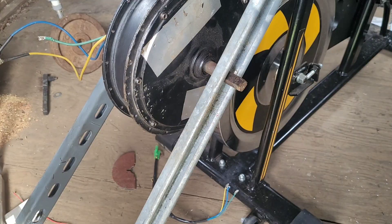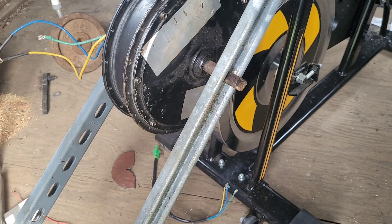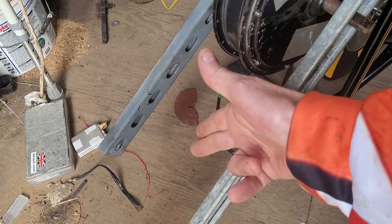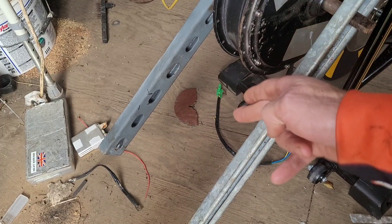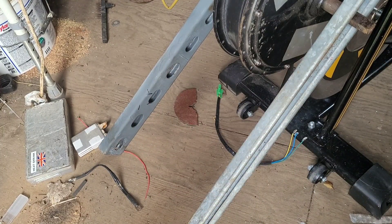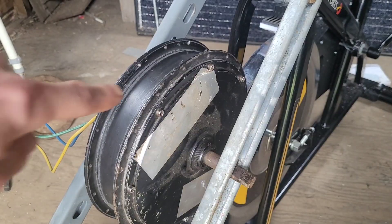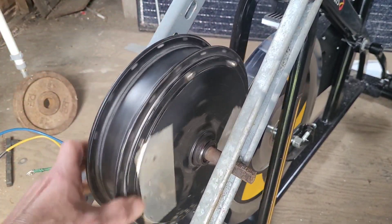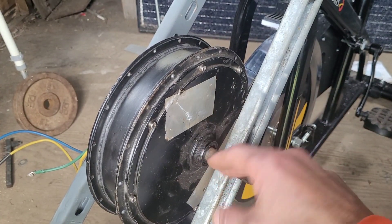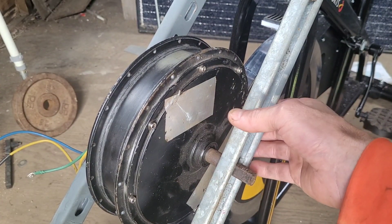I've got the wind turbine set on 24 volts today. I think it'll get up to 24 volts quite easily. When the wind stops tomorrow I can basically have a go on that and see what happens. The other option would be to create some kind of plate here that we could put that five kilogram weight on — perhaps a metal plate with a bolt just coming up, then you could put the weight on there, and that may add the further traction that we need.